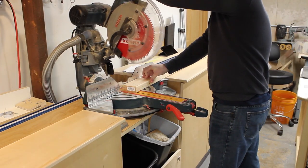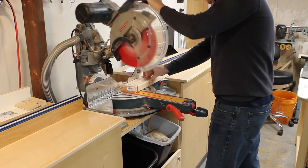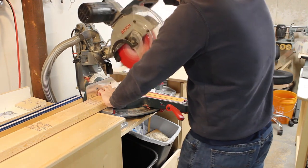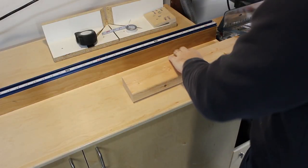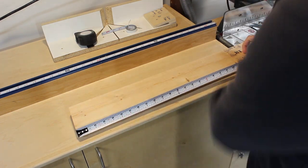So first I set up the miter saw to 5 degrees, locked it down, and I made all these angle cuts in one shot. This ensured that all the parts were cut with the same angle and everything would line up. By the way, if you guys haven't seen the build video for this miter saw station, check it out, I'll put a link below.